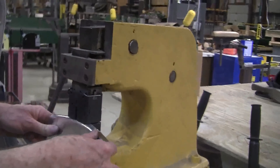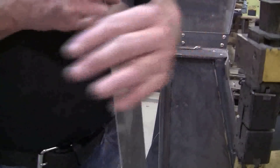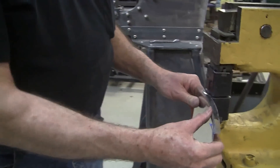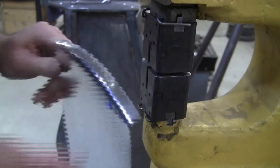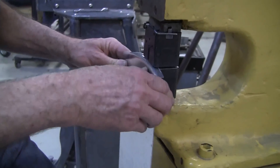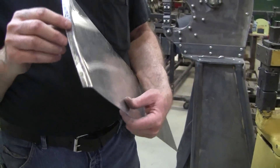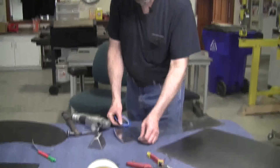It's always this triangle action - if you go in a quarter to at maximum half of the way, you can move it nicely. There's a pretty nice little curve and we've maintained the straight edge - the radius can be tightened up a little more, but that's not bad. That's one way of doing it just with a pair of vice grips. Now I'm going to cut that flange off and put a new line in here, parallel to the original.